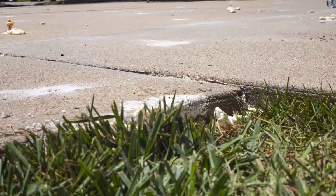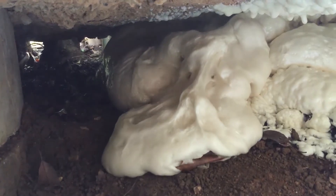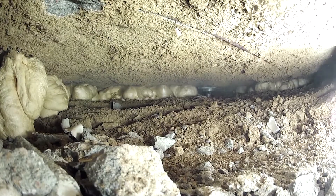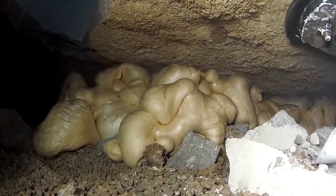This gives us a great deal more control over the concrete lift. As the fluid spreads, expands, and pushes, it doesn't rely on the buildup of pressure like mud jacking does. So if it does find a leak, it only takes a couple of minutes for it to harden and block off that path.